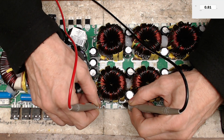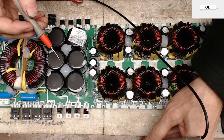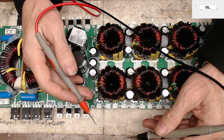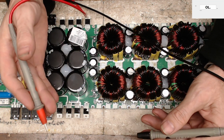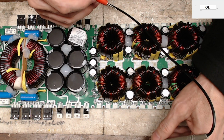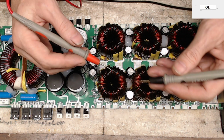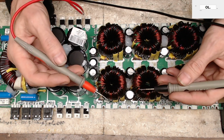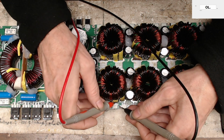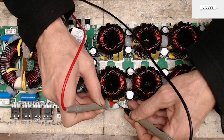Which again goes back to these SMD resistors, like the ones I just pulled off. They physically will look burnt more than likely if they have failed, and they did not look like they were burnt. But I pulled them off because they're the easiest to pull off first anyways, just to isolate the gate drive path to ground, which will allow you to test your gate resistors without having to take into consideration you have a resistor to ground.